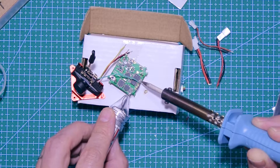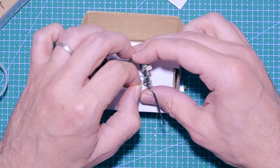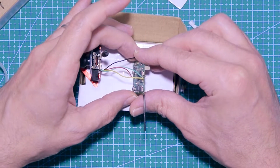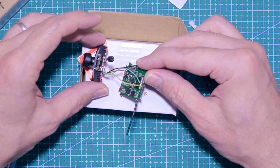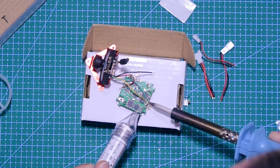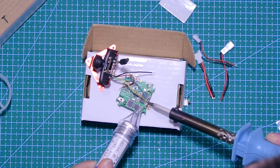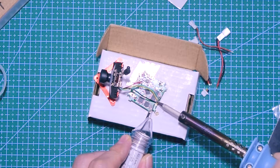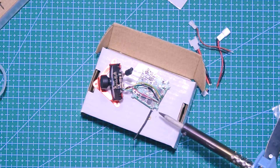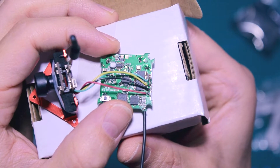I add a little bit of solder — this is very small cable so I'm using a very thin solder. I do the same with the video out cable. It's a bit tricky; I wish I had another pair of hands. Again, add a little solder — these pins are very close together, so make sure the solder doesn't contact adjacent pins. Then do the same with the ground and the 5V cable. The final soldering is probably terrible but it's what I came up with.